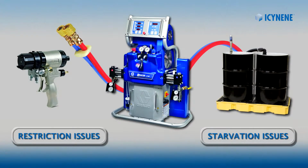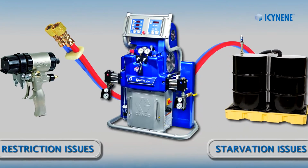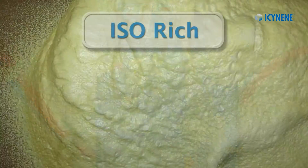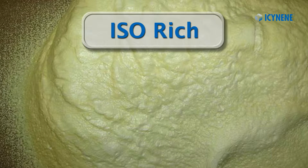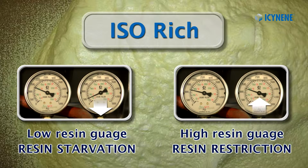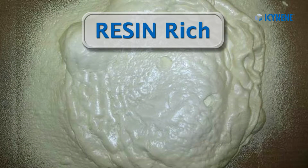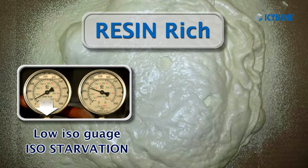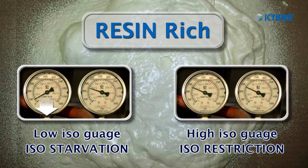Next, we will determine whether we have a starvation or restriction issue by checking the pressure gauge of the fault material. For example, if your foam is iso-rich and you are missing resin, a low resin gauge will indicate a resin starvation, while a high resin gauge will indicate a resin restriction. Likewise, if your foam is resin-rich, then you are missing iso. A low iso gauge will indicate an iso starvation, while a high iso gauge will indicate an iso restriction.